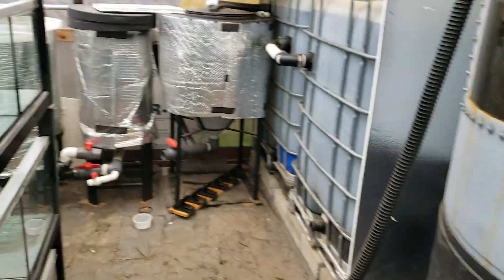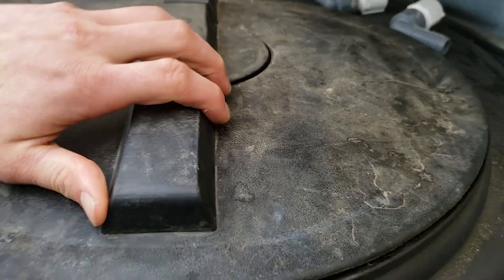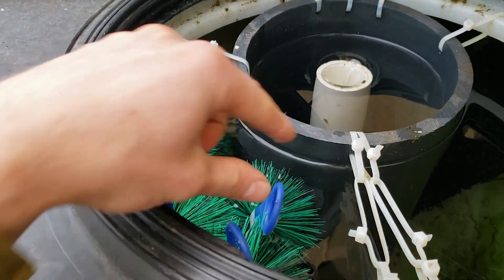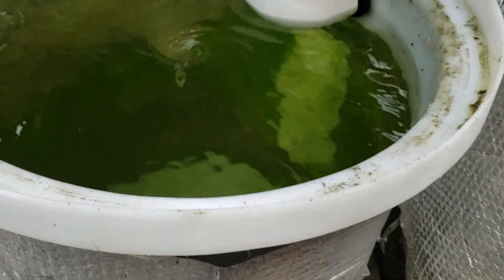This is the one side and the other side is basically the same concept. You've got your radial flow filter which is also set up already. I have the radial flow filter over here, but the issue with this side is the water flow is too fast so it doesn't settle out too well. I put some sponges in there to help with that. This one will be a moving bed biofilter, same as the other side - I haven't put the media in yet since I'm still figuring out the aeration. You can see how quickly that water is moving, creating a little vortex in there.